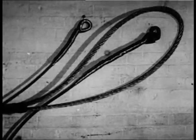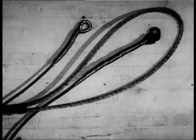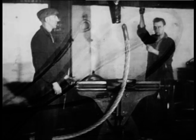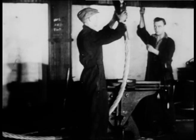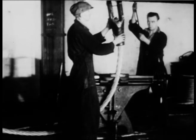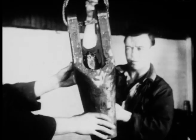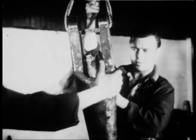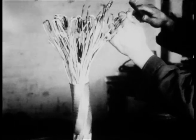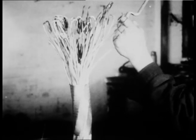The thimble splice, eye splice, and Bordeaux connection are only 3 of many possible fittings. Another is a hand-forged conical anchor socket. It's used, among other purposes, for straining guys for aerial ropeways. The socket is threaded onto the rope. The rope is opened out at the end and bent back. This cone is pulled back into the body of the socket.